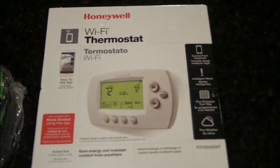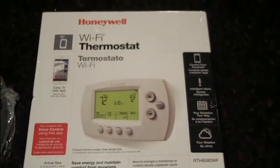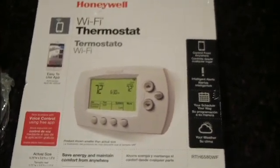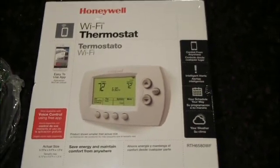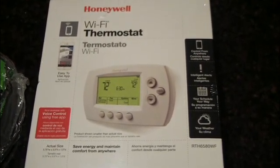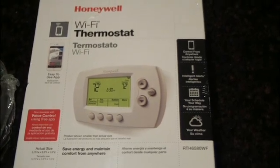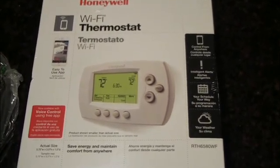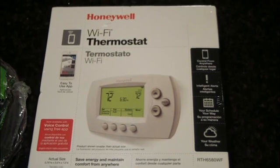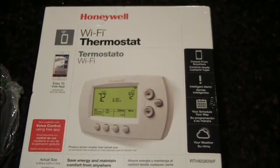Hello and welcome to Jay's helpful videos. Today I'm going to show you how to install a Wi-Fi thermostat, but more importantly how to run the C wire to power the thermostat. My old thermostat is battery-powered and doesn't require the C wire. I'm going to show you how to run one simple wire from the thermostat up to the air conditioning unit to get that C wire needed to power the thermostat.